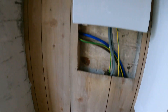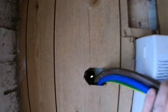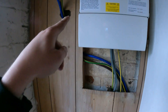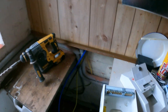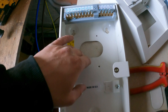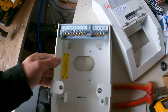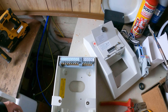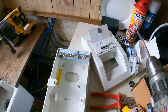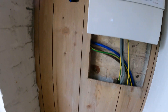Here's where I'm up to — got my hole cut out for the board, tails are in, the hole is through the brick for the armour to come in. I'd have liked to just drop them straight down but I had to come through here like that — couldn't go up there because of the pipes. First time using a Contactum board. It doesn't come with any grommet strip like a fuse box does, so if I can't find any in the van it's going to be the old school bit of twin and earth. So please, keep the nasty comments to yourself. Then I'll just pepper the back with some intumescent sealant once I'm done.